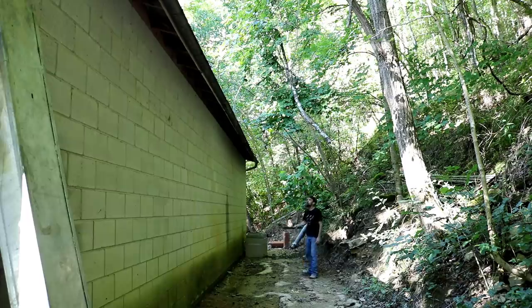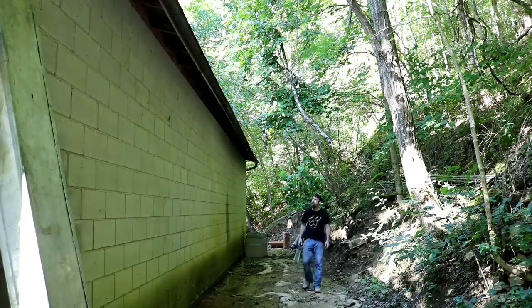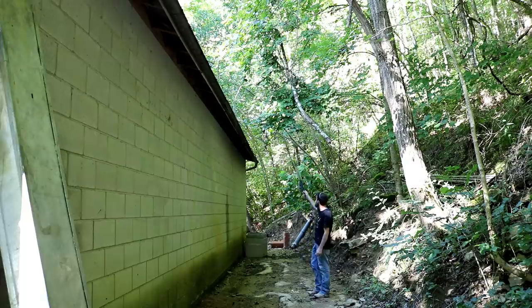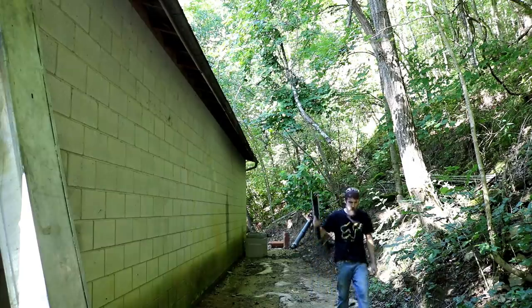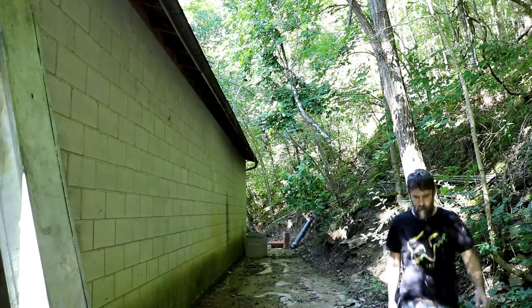You don't want that. But bad gutters or gutters that are full probably do more damage than no gutters at all, because that water just overflows and gets the wood behind the gutters wet. Makes your roof rot out, which you don't want. I'm going to also trim these trees back a bit, because that's not helping things. And then we'll get up there and try not to fall.